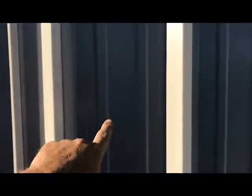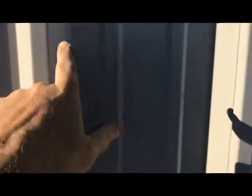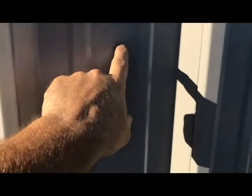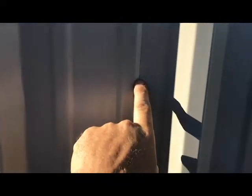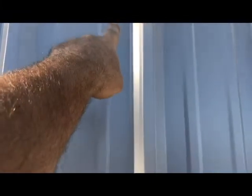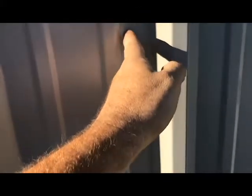So basically it's going to go about there. What I'm measuring and paying attention to is where my cuts are going to be. I don't want a cut to be on here because you'll never hide it — you want it in the bigger section. Here's my mark from there over to here, all the way up to there. Here would be a perfect cut because then this is what we're left with — a nice flat surface for the trim so it'll sit nice.